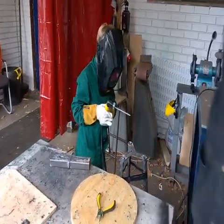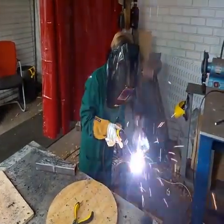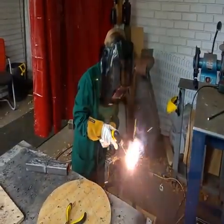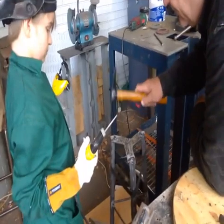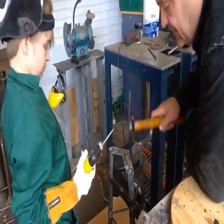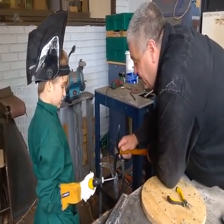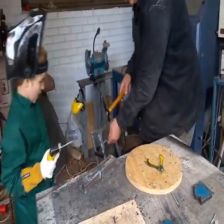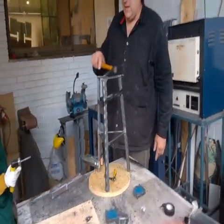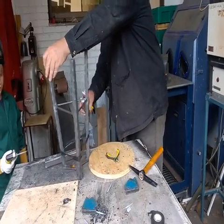Ready for you to go again. So despite all the scratching, those welds are good, yeah? There's a little bit of improvement there. Very good there. Average. Very good. So there's a range of different things, but they are good. Now, be careful because this thing will be hot. So what we'll do is we'll take a grinder and flatten that and clean it. Now put a fresh rod in.